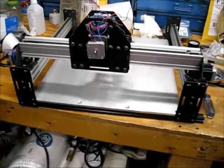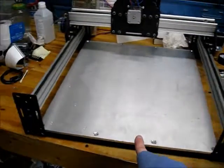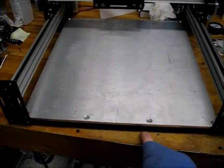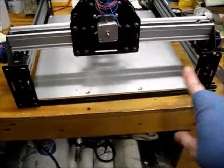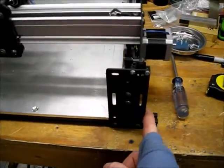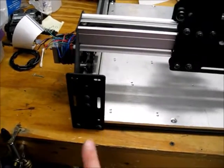After that was done, I picked up the whole unit and spun it around — it's really a pain with the camera. Now on the other end, these two bolts are loose with respect to the rail. So I pulled the gantry all the way to this end to get the spacing between uprights correct, lined up the end of the extrusion with the plate, and tightened those two bolts. Since the gantry was all the way down, I could have tightened the remaining two, but I decided not to.